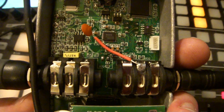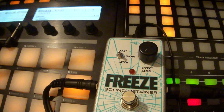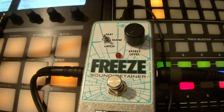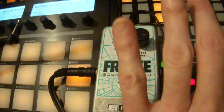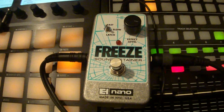It's actually the mixed signal that goes to the normal tip of the cable. So now the effect level knob acts as either a wet out or a dry out. If you have it all the way off, then just your dry signal appears at the output. But if you have it turned up, you'll get both the wet and dry signal — you're just going to have to trust me on that one.